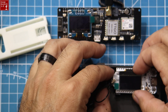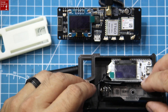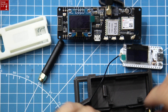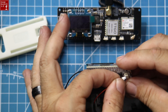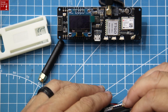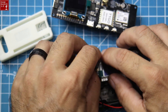I got that connected on the board and it just sits here like that, with the USB-C out the bottom. Now this 18650 goes in like this — I don't think it matters which way it goes up or down. It just kind of pops in the side there. Make sure it doesn't impede the antenna, make sure it fishes around there fine. Now this connects to the underside of this board right there. You've got plenty of room around this — you don't want to put it down in here with it sitting on the coax where it's going to pinch the coax or the battery leads.